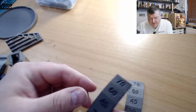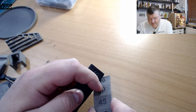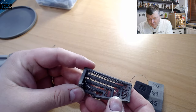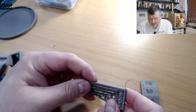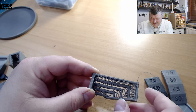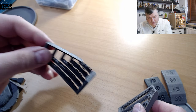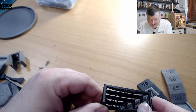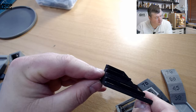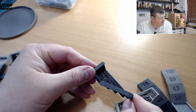You can see the carbon fiber part is a little bit cleaner on the top part. I think that's because of moisture causing some stringing issue. I did a bridging test and with no fan it's a difficult test, and for nylon this became a difficult one. Printing at 295 degrees, the bridging results with the carbon fiber are a little bit better. You can see the bridging has some issues, but still the top side looks great.